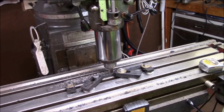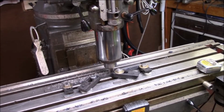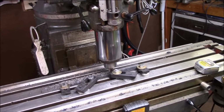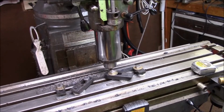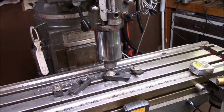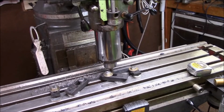And basically what I've had to do is use a smaller mill and take smaller cuts and clamp it to the table really good in multiple passes. It's just something I haven't done, just didn't put the right thought into it. So now it's a simple matter. We'll just leave the clamps on and roll it over to the other side.